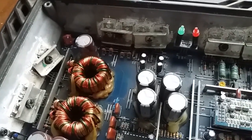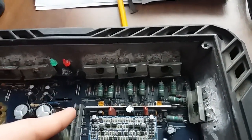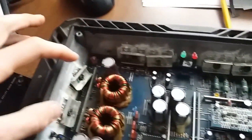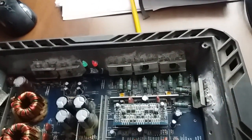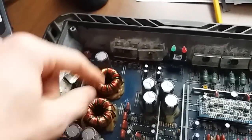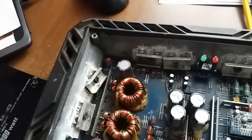And why this thing may go boom is also because, as you saw, some of the transistors, not all the transistors, have insulating pads, and that's an entire aluminum piece. So tying them together like that, some of these transistors are tightened directly, and some of these, not a good practice, absolutely. That's gonna cause you trouble. So that probably by doing this bodginess, he created a short on the output of this DC to DC converter, and that's what fried it. Yep.